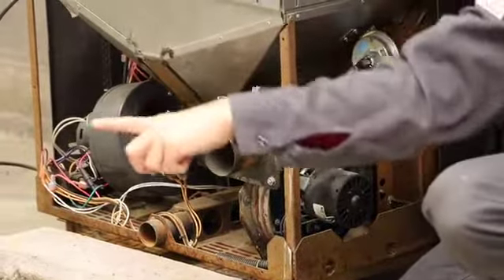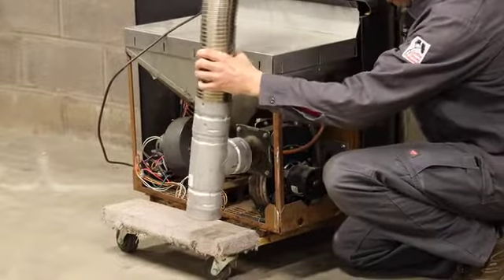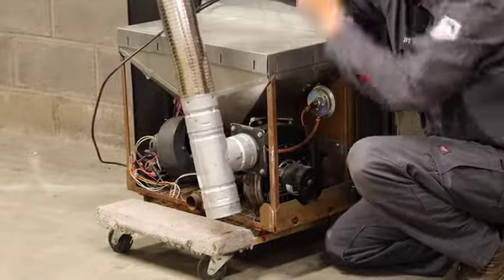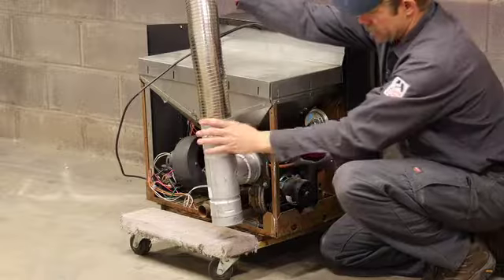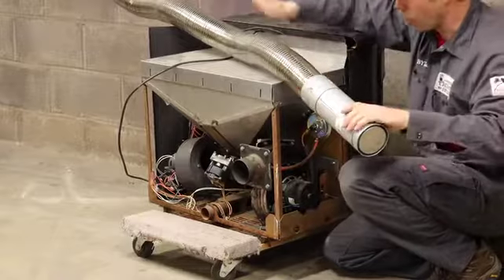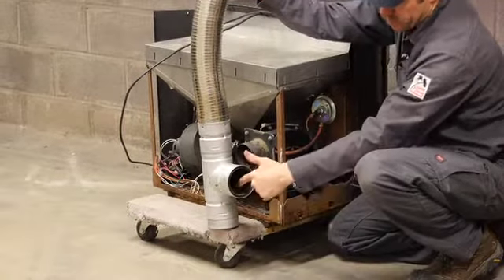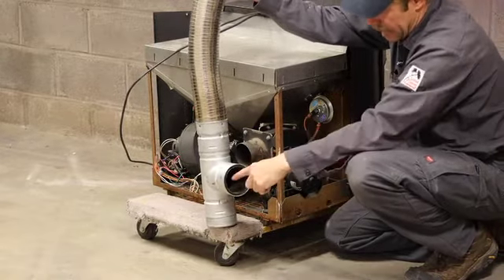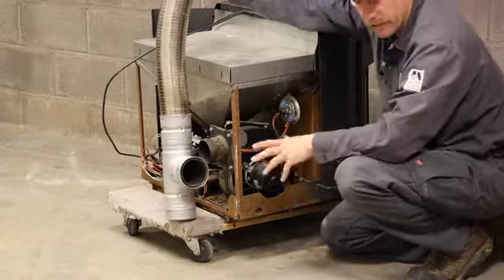The exhaust contents are propelled into a T and out. In the case of an installation in a firebox — this is an insert — it'll go up through the old factory-built fireplace or the old masonry fireplace and this vent will go up and out to the top of the chimney. You'll need to remove the T cap and run your brush up and down, or sometimes you have to physically disconnect the T from the appliance to get the ash and soot out. If you sweep from the top down it'll build up with ash and soot and you've got to get back in here and vacuum it out.